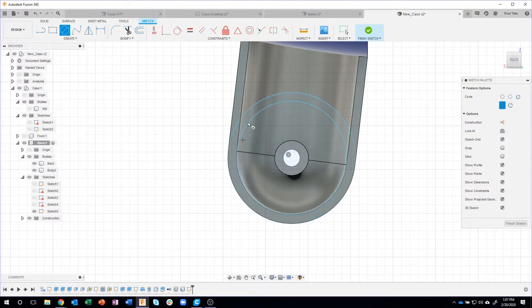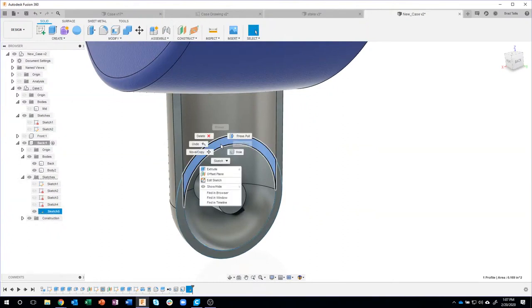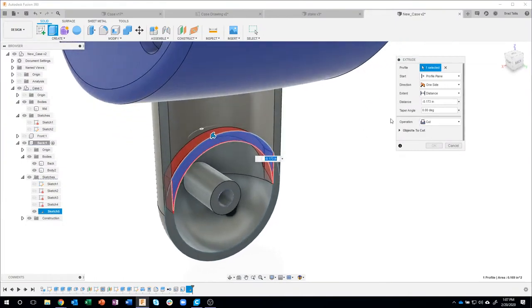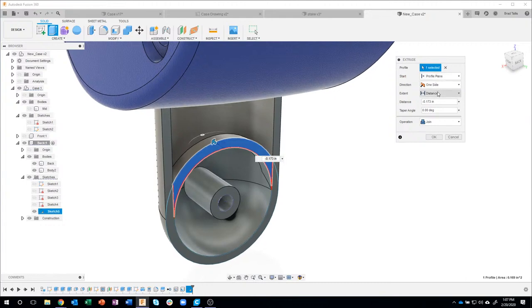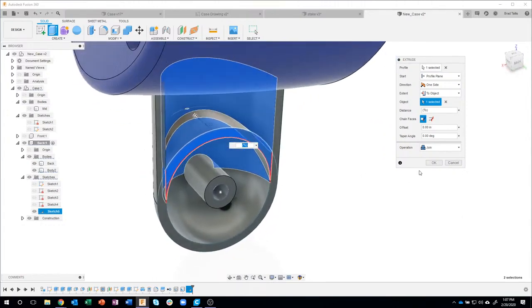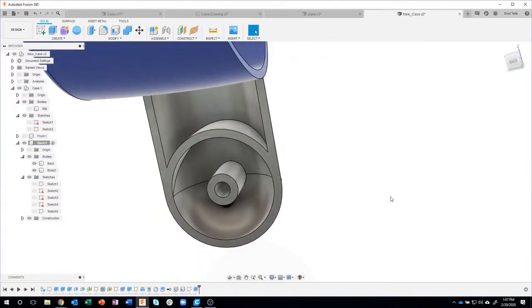And you can kind of see, we're just going to continue with that profile. Extrude, I start to drag in the correct direction. I'm going to say join. How far? I'm going to say to object and just click on that curved face, and it's going to take that profile and extrude it back to that curve, like so. Okay,